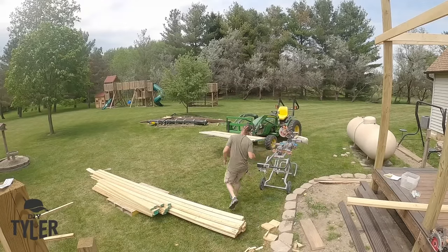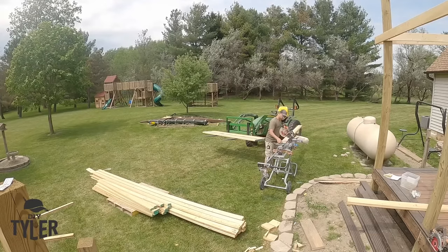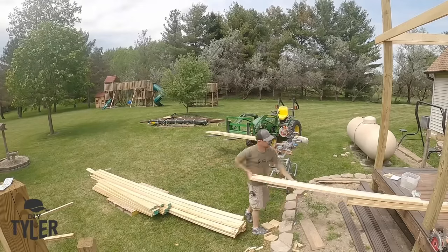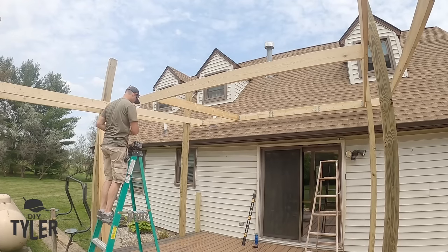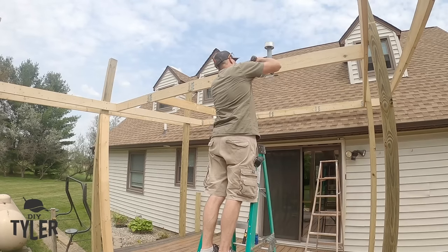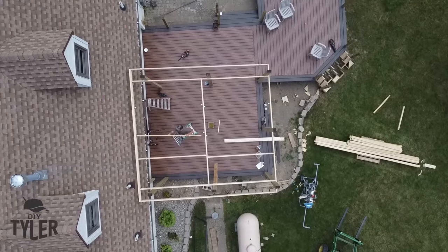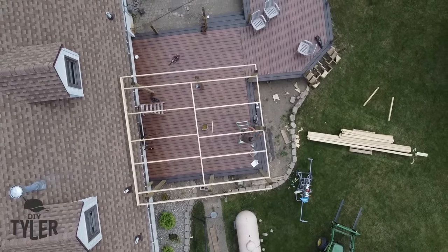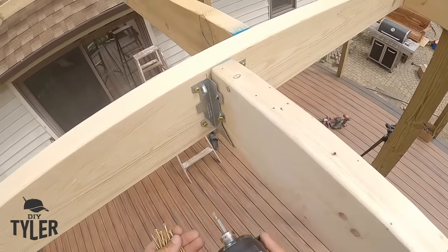Once all the outer support was done, it was time to cut all the boards that go inside — you might call these joists; they're the equivalent of what a joist would be for a floor but on a cantilevered roof. I cut them all to the same length on the miter saw, since the board in the middle is exactly centered. Then I mounted typical joist hanger brackets on both sides of the frame, dropped all the cut boards right into those brackets, and fastened them firmly with two-and-a-half-inch Torx-driven deck screws. The structure got more and more sturdy with no wobble as more pieces were added.